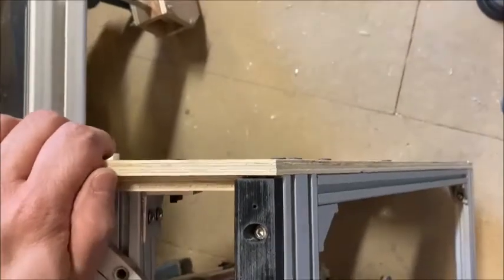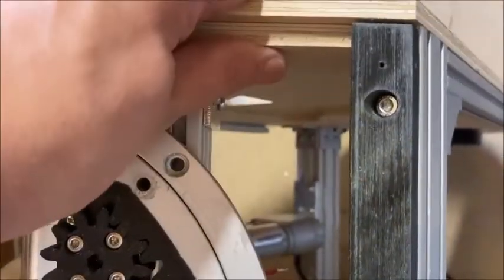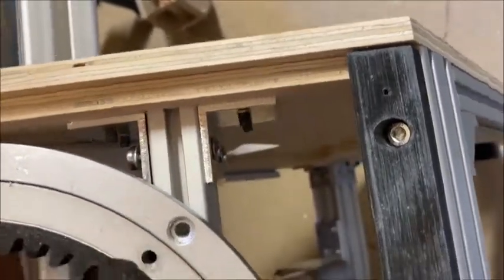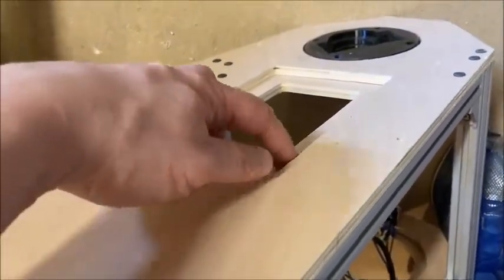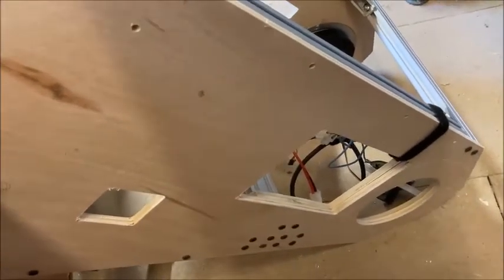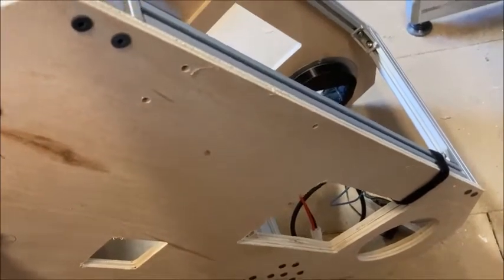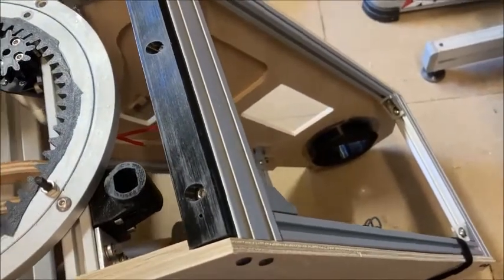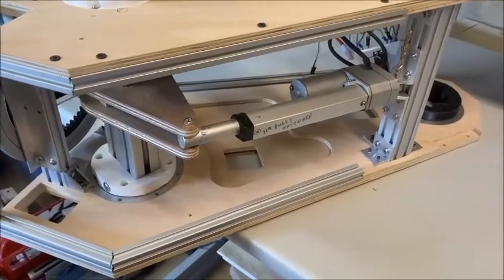The outer frame of T3 is two CNC'd 9mm thick panels, and again this is where I've made another mistake. On the other side I've messed the hole up so the actual skins don't fit on, so I've had to cut those so they fit properly. I need to go back and cut some new inner skins so they fit properly — and when I say inner skins I mean the plywood skins, not the outer styrene skins. While it's on the bench it's easier to see what's happening.